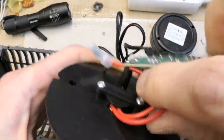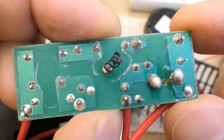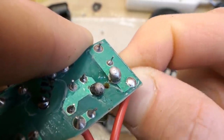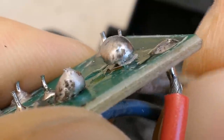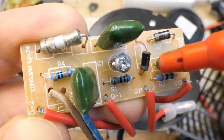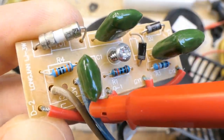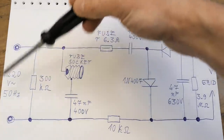There are two wires going from the board to the tube socket. Taking the socket off reveals the bottom of the board, which is quite dirty. But there's one bigger problem - this solder joint: the solder joint of the main cable is completely loose. It was probably still making contact, otherwise it would be completely dead. How does this even get to the European market? The board contains a fuse, three resistors, three capacitors, and two diodes.